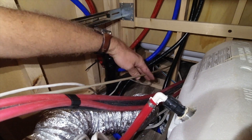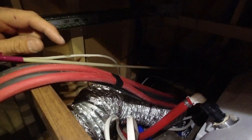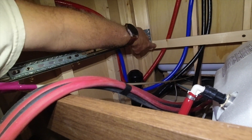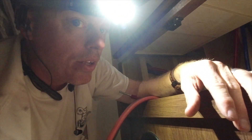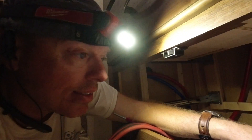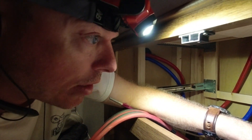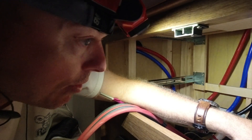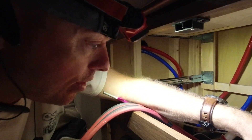This is the wire for the 712, which I'll be putting right here — all the batteries will come and connect here. There are six batteries in this system, and I'm still working on what to do for the last two. He said he'd be willing to give up the bottom drawer, but that's not how I work — I want to fit them in somewhere so he doesn't lose any space. We're doing six batteries, four panels at 1,280 watts, a battery monitor, and a 3,000-watt Multi-Plus. Let's get back at it.